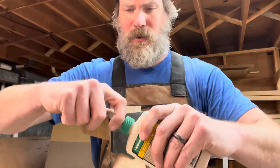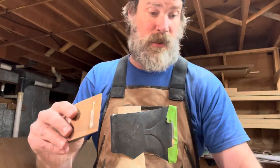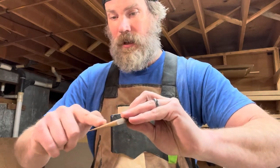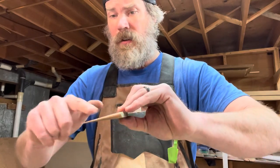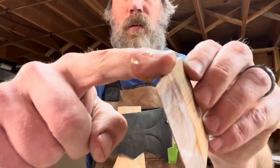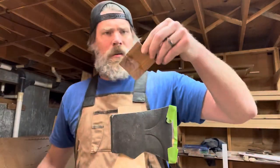So first I'll put like a little dab of glue — I'm not going to go crazy with this. Then I put just a touch of boiled linseed oil, like that at most, on both sides. This glue sticks pretty good and sets up fairly quick. I started using glue — I used to just do boiled linseed oil, a lot of people do that. But I just kind of wanted a little extra stick to it. I noticed when I first started doing it, it gets fairly tacky fairly quick and I wanted a little less friction. So now I'm grabbing my boiled linseed oil, just a little bit there on that leading edge or trailing edge, just to help it slide a little bit. I don't want to put a whole bunch around the glue.